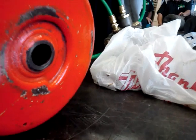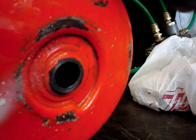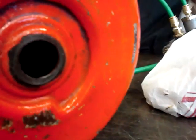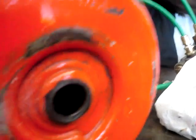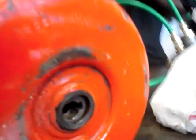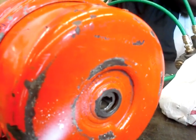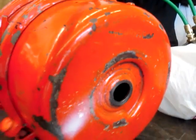But as you look in there, when I push shop air in here, the rod here will retract in, compressing the spring inside of the emergency brake side. Now, as you can see, that's where you will put your key to cage the brake chamber.